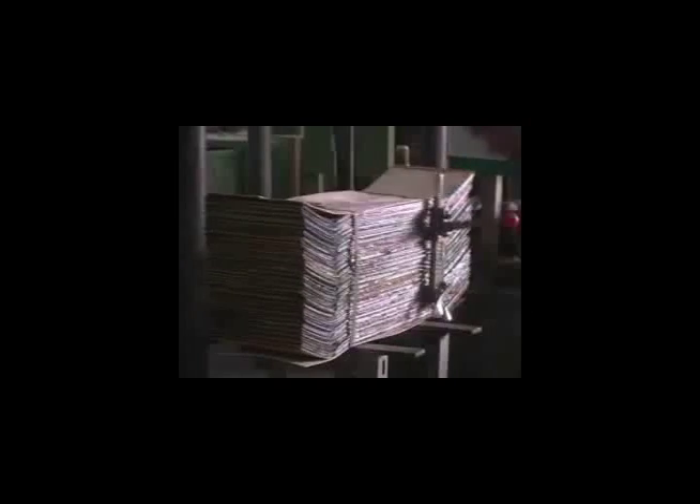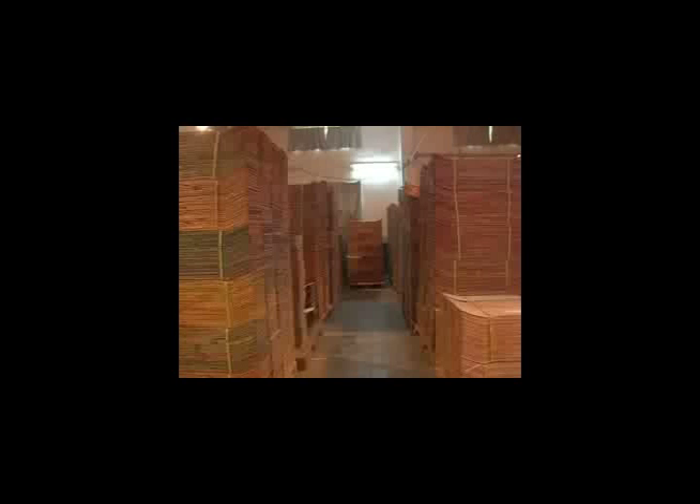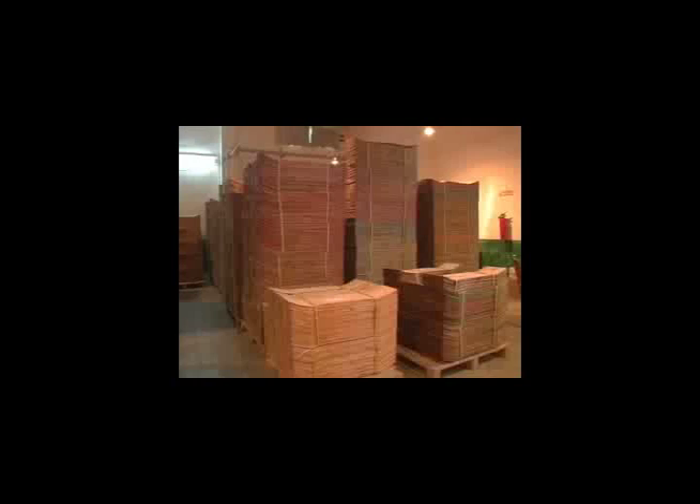If the glue isn't allowed to dry properly, the wood won't retain the mold's form. That's why from the very start we took extra steps, both in procedure and within the actual facility, to treat the decks as if they were patients coming out of surgery, allowing them to recover in tightly controlled rooms where the decks could stay cool with several finely tuned humidity control devices.